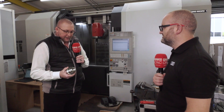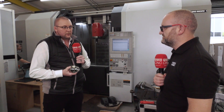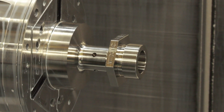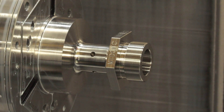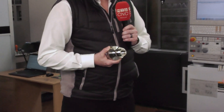We've done one part and it's barely done anything to the insert. So what's the cycle time? The cycle time for this part was 23 minutes. The trochoidal section we were down to five minutes, with conservative data. And that's Alloy 718. Yeah, we love these materials — we've got such strong products and it lends itself to these materials. So if you'd like to machine Alloy 718 and want to learn more about ZCC Cutting Tools products, why don't you get in touch.